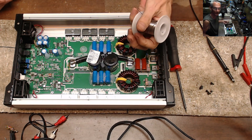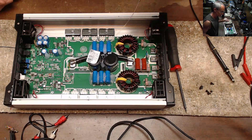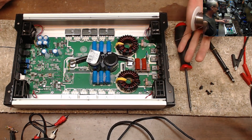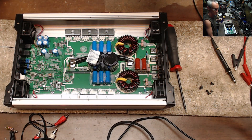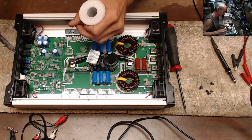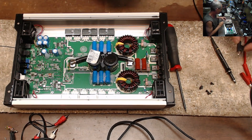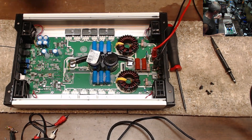I'm going to show you real quick how you go about testing these without high voltage — you can test these with 12 volts. You just need a few tools: a T10 screwdriver, a power supply, a scope, an input signal, a remote lead. Within this amplifier there is a little section labeled 'Test 12.6 volts DC.' What you're going to do is jump that, hook up your power, then fire up the remote.